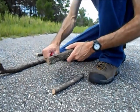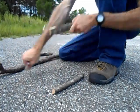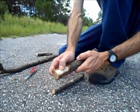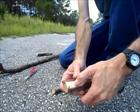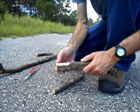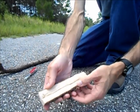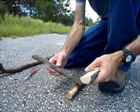One way I like to test the wood is to cut off a little bark. I like to press my fingernail in and see how it holds a little etch there. That's what I'm looking for — the etch test. If it etches, I'm usually good to go. If it presses in too far, it's probably rotten. If it doesn't etch at all, then it's too hard, like the bearing block I cut from that scrub oak.